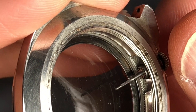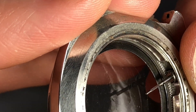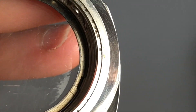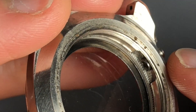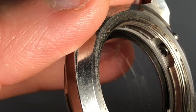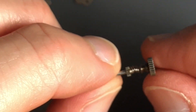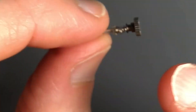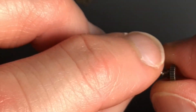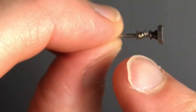So if you come across one of these watches and the bezel isn't working, you have a pretty good idea — it can only be one of a couple of things. Either the stem gear is missing, which is usually the case. But it is possible that these teeth — as this ring is just plastic — can become broken or damaged. A lot of that has to do with the fact that when people replace these stems and gears, if the spring is missing or misshapen, they'll use a much heavier gauge spring that doesn't allow the same ease of movement. Forcing that metal gear to mesh with those plastic teeth, it's pretty easy to damage them. Something to keep in mind.